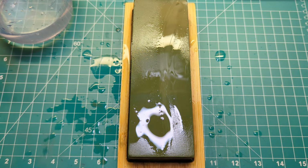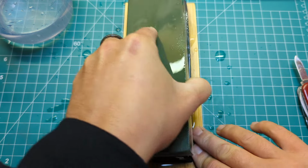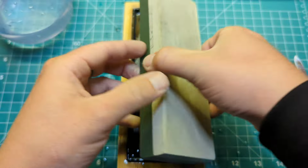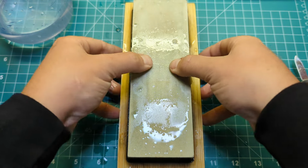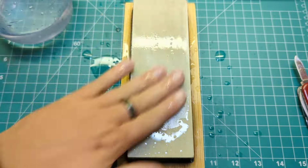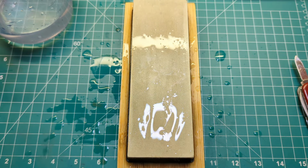Have a look and see how we're getting on. Of course, now Victorinox knives, they never need to be super sharp. They're not a hard use knife, and recently I've liked leaving not super toothy edges on them, so they stay sharp a little bit longer with a bit of a toothier edge. You haven't got to worry about, like, if you're cutting rope or anything like that with a Swiss Army knife, it's going to dull quite quick, but it's not the best heat treated steel. It's quite a budget steel, but one of the reasons I love it, it sharpens up so easy. But that's what I'm going to be doing with this. I'm not really going to be taking it any further than that.